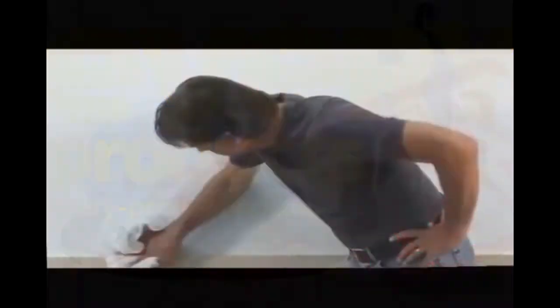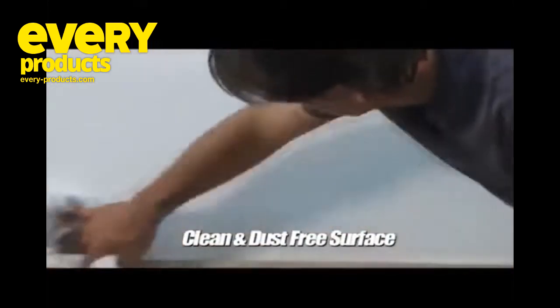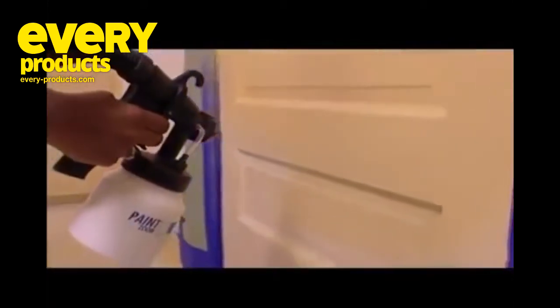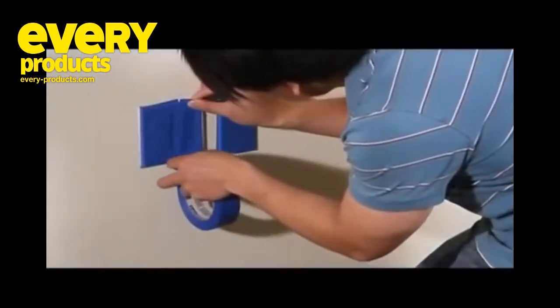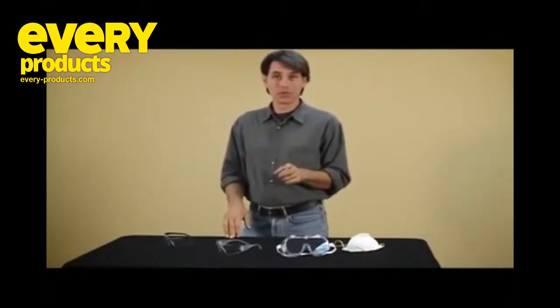You should always make sure your surface is clean and completely dust-free. This will ensure you the best possible result. Although your paint zoom will produce very little overspray and paint mist, we recommend you cover any surfaces you wish to remain paint-free with a drop cloth and tape off all moldings, outlets, window frames, etc. And remember, keeping yourself safe is the most important thing.